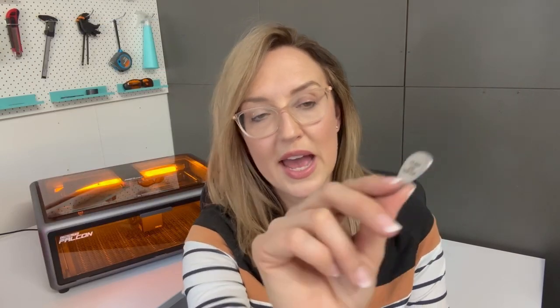Aluminium — you can only do anodized aluminium on the standard diodes, but the infrared allows you to use raw aluminium like I've engraved here. I picked a guitar pick, and because of the little spot size on the 2 watt it's very, very fine detail and you can feel it to the touch. It feels almost like the branding on my oven with the heat settings — you can feel that engrave. It's a good result.